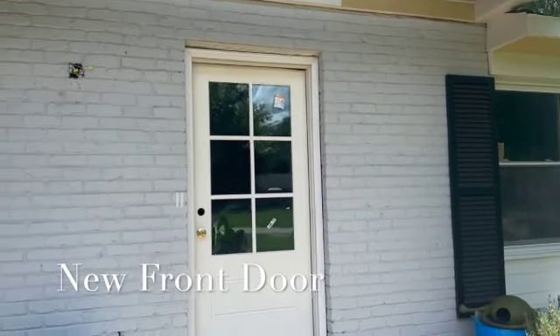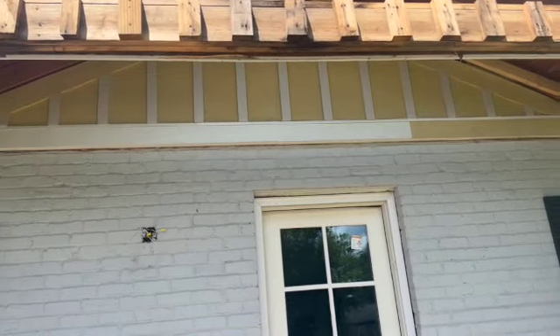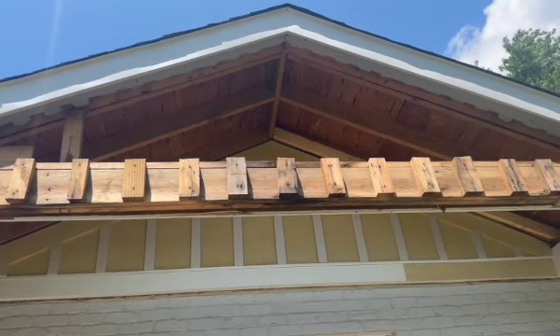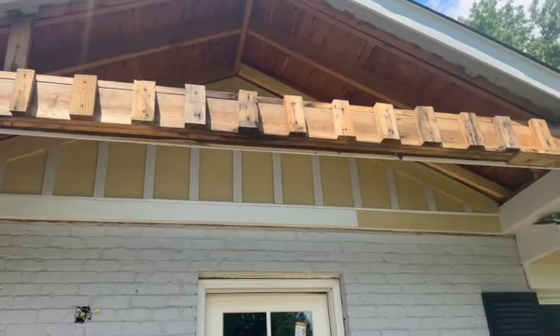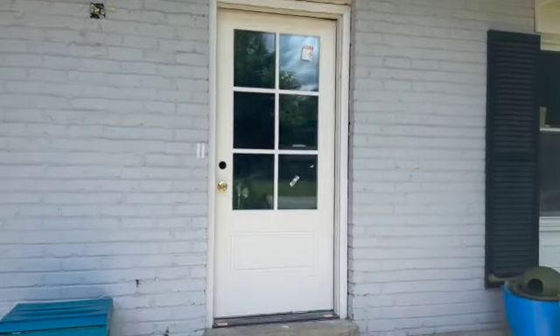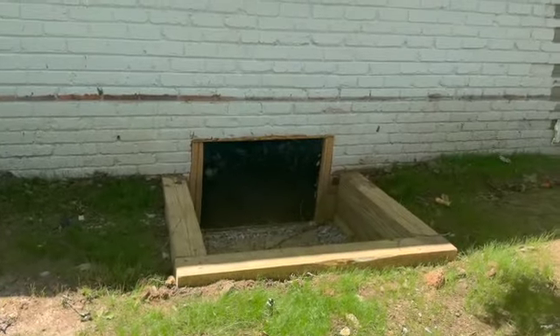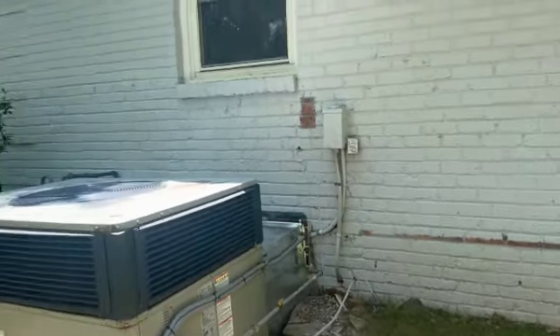Let's go out front. We're outside and you've got a new front door — that wasn't in our last recording. You've put the hardy plank board and batten up in the space of the overhead porch. The exposed wood will all be wrapped with a stained wood trim, same wood that's going to be in the back covered porch. Outside you're basically done except for the exterior coat of paint. The HVAC system is finished around back where you dug in and have access. The crawl space is encapsulated — sealed on the sides, across the bottom, with spray foam insulation around the perimeter.